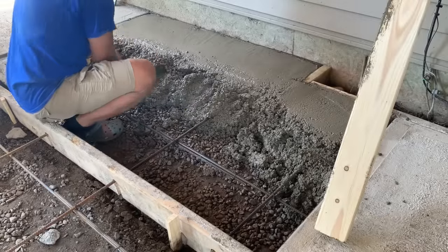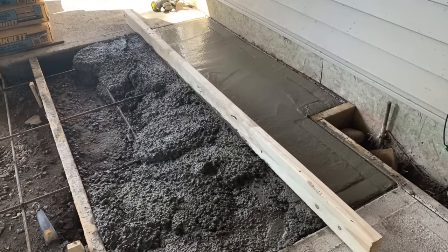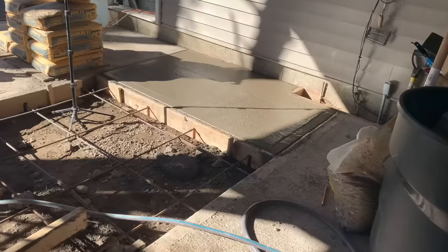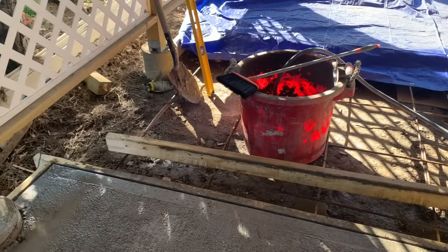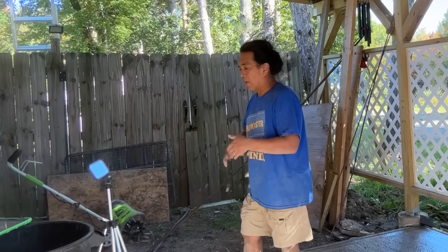I'm really pressing the concrete down to avoid any air pockets as well as around the rebar so it has a good grip. This is what it looks like when done. I completed one half of the slab — the other half will be on the other side, probably at the end of the week. In a couple of days I'll start the middle half. I took my time with the half slab — there was no rush, and I was still sore from the day before. I'll give this time to dry and move on to the next project. I won't do a video on the other half since it's the same process.